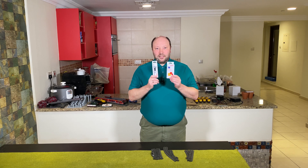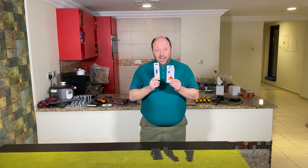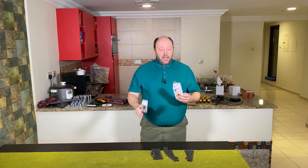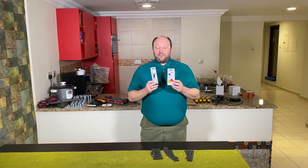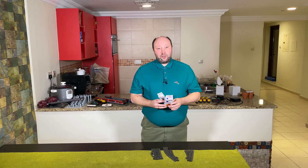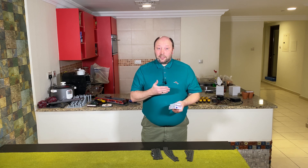The turnout mechanism is the little engine or mechanism that physically makes the turnout change and turn. From Märklin the turnout mechanism comes in three different versions. The oldest one is the 74490 — that's the original one. I also have the newest one here, the 74492. If you have a 74491, please install it as the 74492. Whenever you're fiddling with the electronics and the tracks, always read the safety instructions and do the installation with power off.